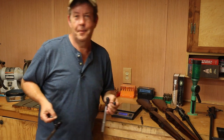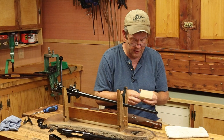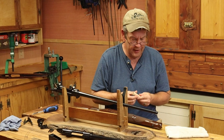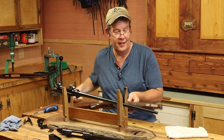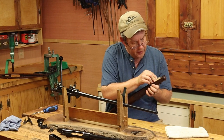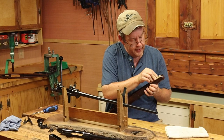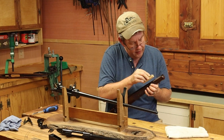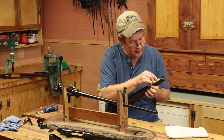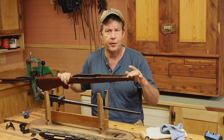For the barrel channel, I'm taking a simple wooden dowel wrapped with 100-grit sandpaper — pretty coarse, but none of this will be seen on the inside. I can see where somebody else has already hit it before, so we're just going to knock it down a little bit. It doesn't take much — we were barely touching the barrel, and we know exactly where we were touching, which is right at the sling stud. I'll seal this up with a little Minwax to seal the wood.